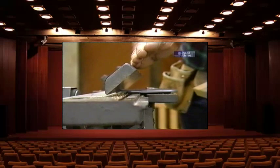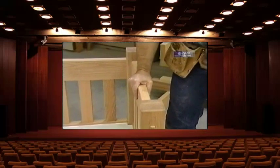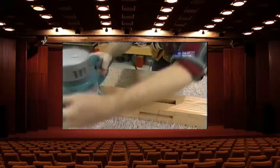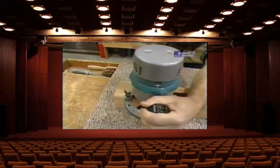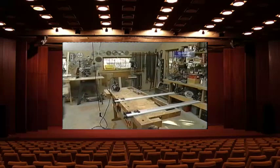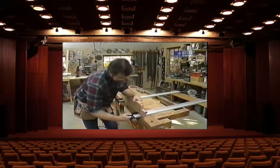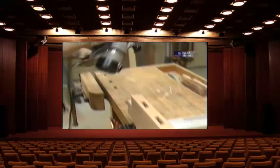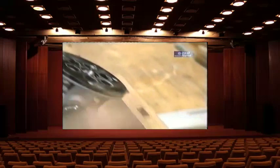I've tilted the fence on my jointer to 45 degrees, which allows me to knock off the corners of the slats. You can't go by one of these pieces without wanting to touch it — that's part of the craftsman style, so it's important that all the edges are eased and there are no sharp places. I'm going to start by easing the edges on the posts using a three-eighths-inch radius rounding-over bit to hit all the sharp corners. Then I switch to a quarter-inch roundover bit to ease the edges on the two-by-six pieces, securing them with clamps to the workbench. I'm not setting the bit to full depth — just taking a little bit of these corners off.